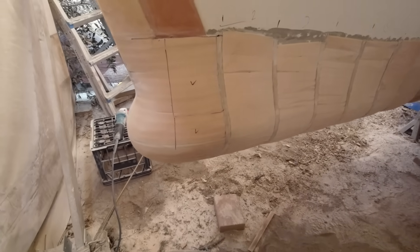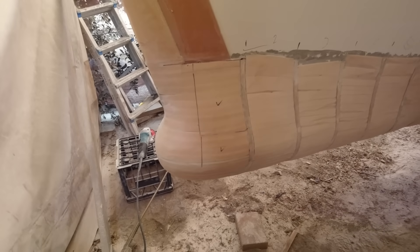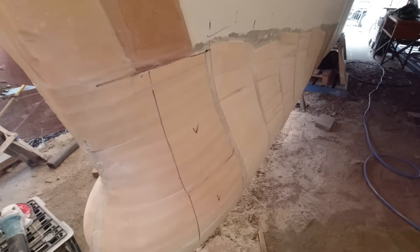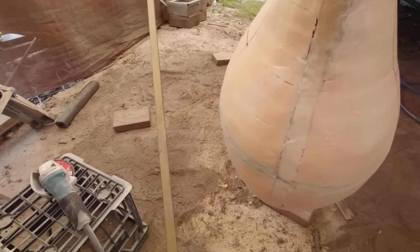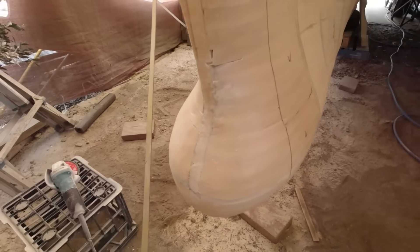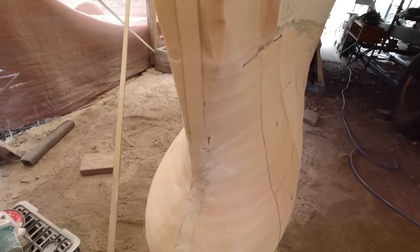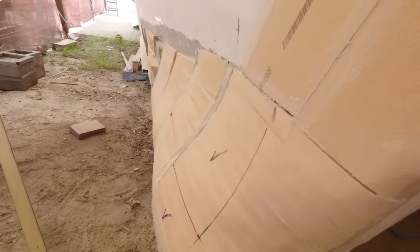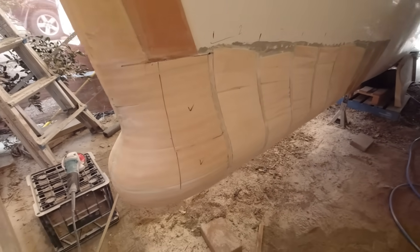The other thing I'm using is a control gauge here. I'm going to use shape-maker jigs to tick off sections as I fine-tune sand them, and I have quite a lot of those to do. It'll actually get easier as I go back. Getting the actual bow shape exactly as I want it — basically this here is done, this here is done, it's symmetrical, and it's actually the same as the other side. So it's very important to get that done, tick it off, and know that it's symmetrical.